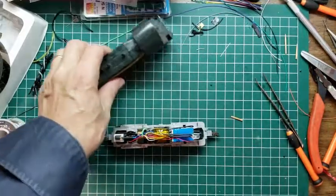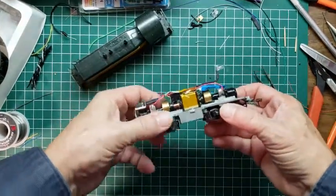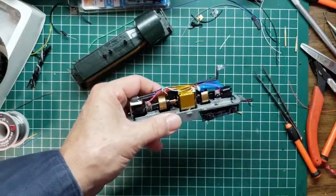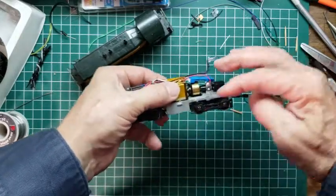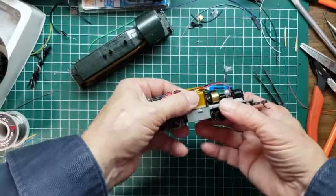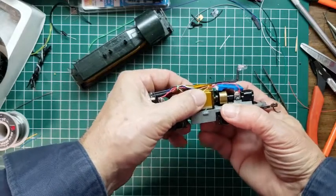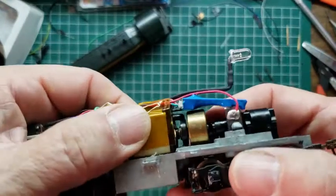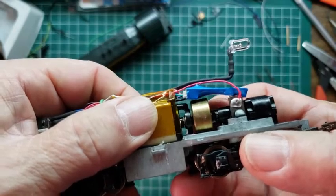Okay, 6 minutes have gone by, and what I've done is nothing more than to restrap this. The Kapton tape that was on there kind of let go. I've retaped it. I've turned the decoder over, right? And it looks like it's touching the flywheel, but in fact there's like 10 thousandths there. It's hard to see when you get close to it. You can see that there's about 10 thousandths space between the two, right?